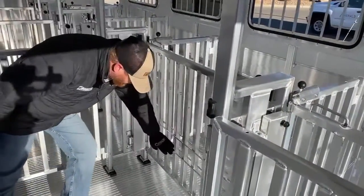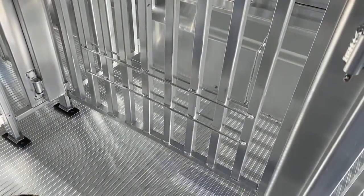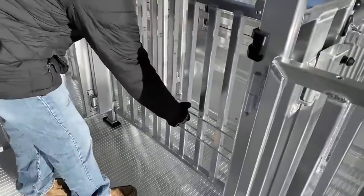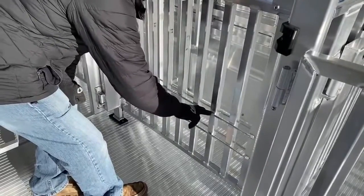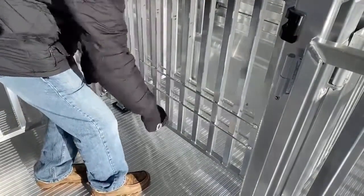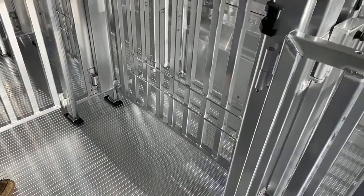On these center gates we put a high and a low feed rail on there. The reason why is we understand younger projects are growing and you're going to get a little bit taller, so you can adjust. We did it on both sides, so when you're clipping feeders on here you're clipping right here. How they used to do it was one bar on one side, so you'd have to reach through — this is a lot simpler and more user friendly.